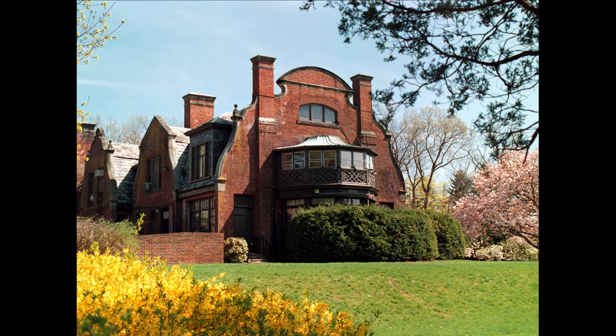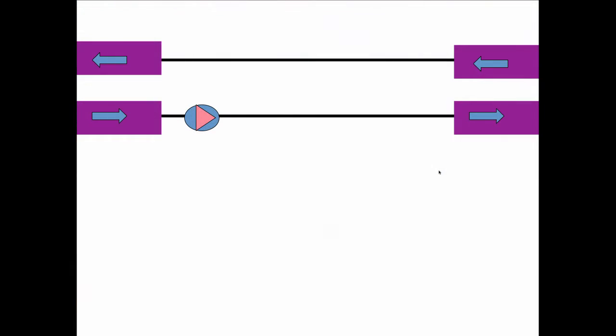So I said, we're going to put in two properly sized boilers, each half of 375,000 BTUs. He said, all right. I said, here's how we're going to do it. You got these 8-inch pipes. There's two going out of the boilers out into the building, and there's two coming back. We're going to tie all those together, and we're going to do that with 2-inch copper.